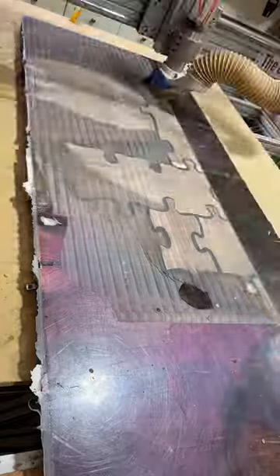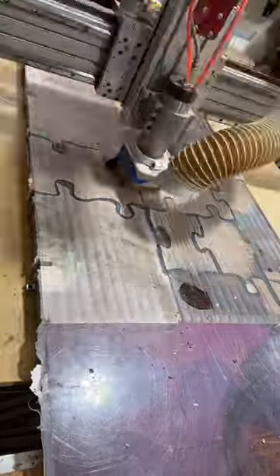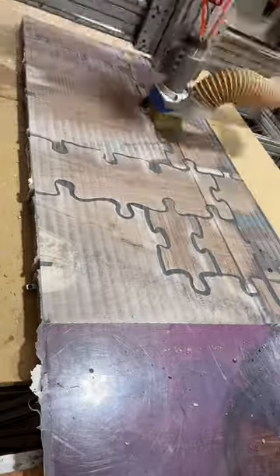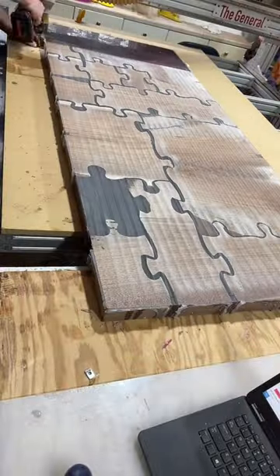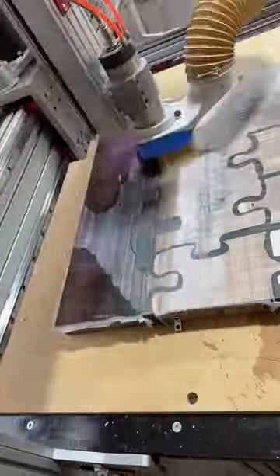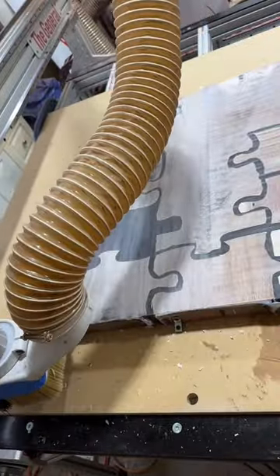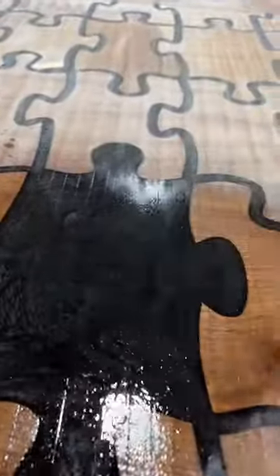The wood has tension built up and the epoxy shrinks as it cures — removing that thin layer creates a spring effect, which is another reason to keep your table as thick as possible for as long as you can. On the bottom we only had to take about three-sixteenths off because we did it right, and the wood grain running in the wrong direction actually prevented cupping. We're talking millimeter-level changes. With zero patience, we do a little preview using alcohol on the table — yummy, I think I'm actually getting excited about having this in my office.